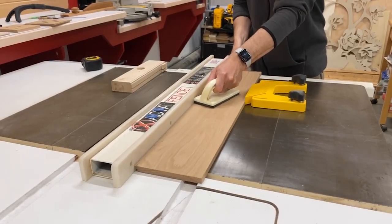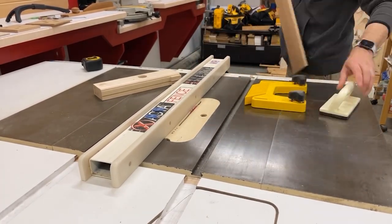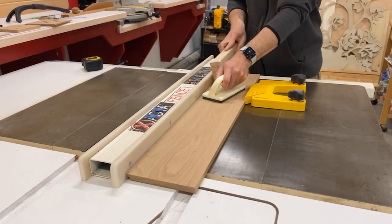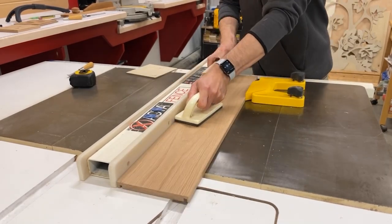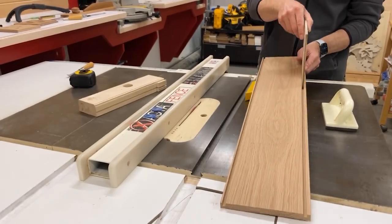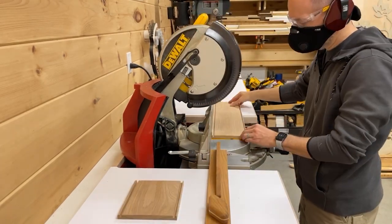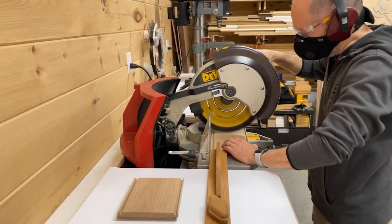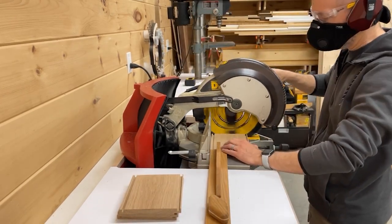I used more of the half-inch oak to make the sides of the box and started by cutting grooves in a piece that's long enough to yield all four sides. I made repeat cuts nudging the fence over a bit until I crept up on the perfect fit for the top and bottom pieces of the box. I used a feather board to ensure the groove didn't drift and I kept light downward pressure over the blade to make sure the groove was cut at a consistent depth. Then I cut the board into the four side pieces. I kept track of the order of the pieces so that I can have a continuous grain result in the finished box. This approach will technically only yield continuous grain on three corners, but this board has fairly straight grain, so I'm okay with the slight mismatch that may occur on the fourth corner.